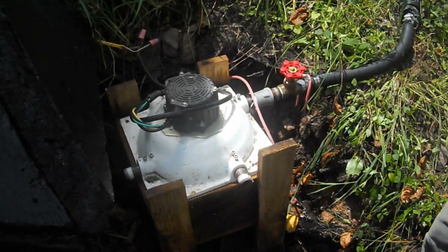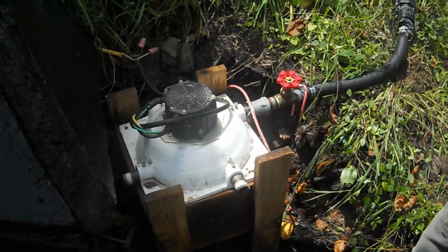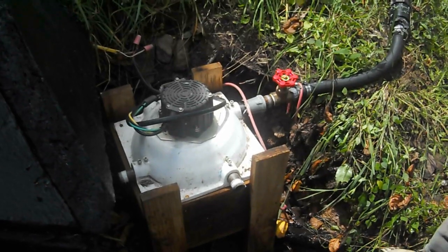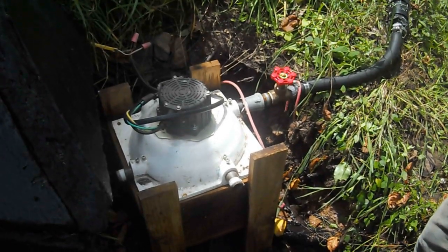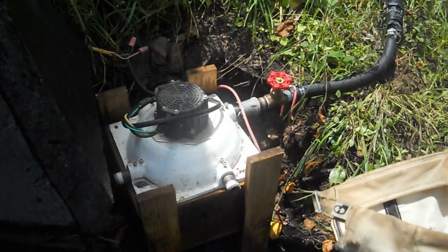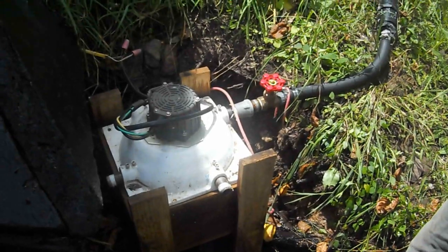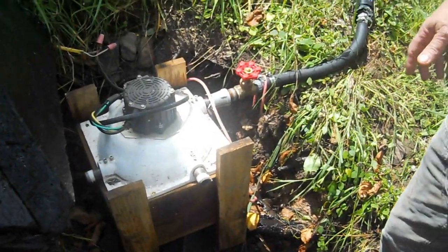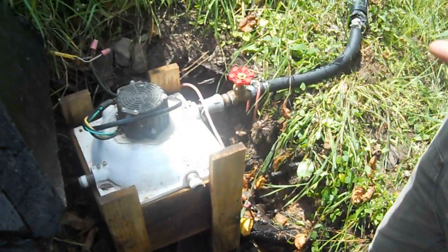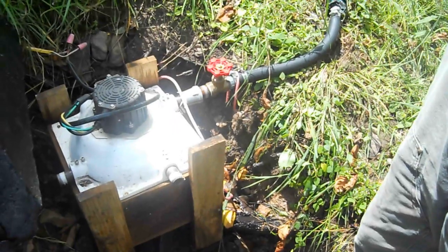What size nozzle? I have a half-inch nozzle on now. I think when I mothball it for the winter — this is a three-season system in my setup — because once the water comes down the hill in a contained pipeline, water can run until 17 below zero. But as soon as you get cavitation or turbulence in there, you have suddenly super-cooled water that can freeze in a minute. So I mothball the system as soon as we get to a stretch of days where the daily high does not get above freezing. Okay, so I just shut it down.